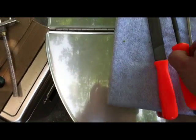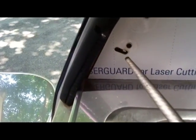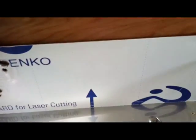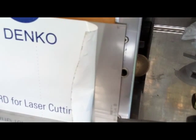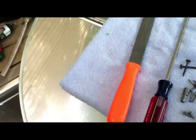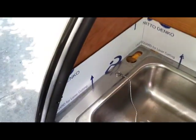An additional tool I'm going to suggest is a rat tail file. They say to place this in here and make sure everything fits correctly. It's okay that these don't line up - that's not going to be an issue. You can tighten them down a little bit loose just like they said - if there's a little one-eighth inch gap that's fine. But right here, if you can see this, it's hitting the screws and they're telling you to trim or file it down as needed. A regular metal file is flat, but I'm going to use a rat tail file which will be quicker. I'm just going to mark right here and trim that out so it goes around the screw and will lay flush against the side of the wood.